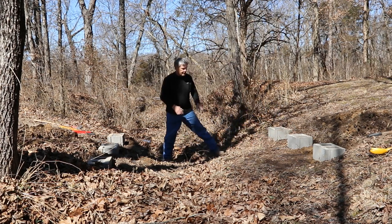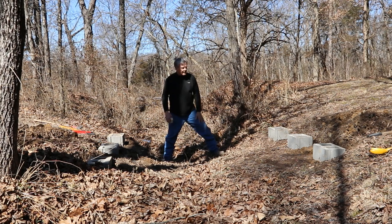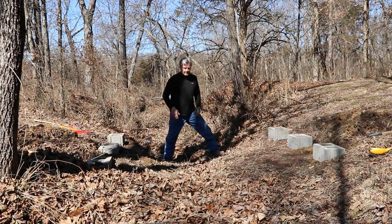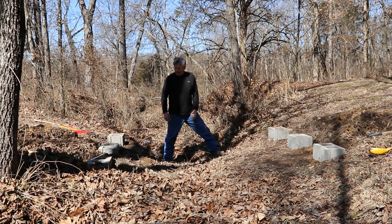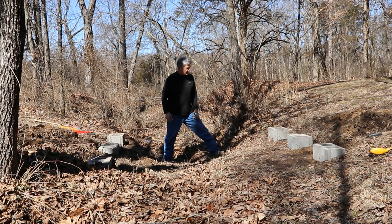Level side to side, we're within an eighth of an inch, which is more than enough because again, as we lay these timbers in, these trees won't be perfect in diameter. So if you're using mill-bought material, then you can get it a little bit closer and get everything set in there perfectly. But within an eighth of an inch, I'll take that with rough material to work with.